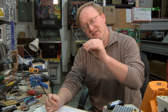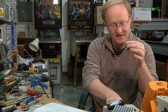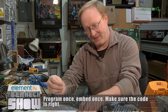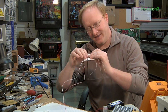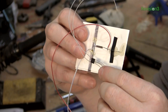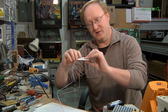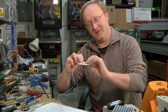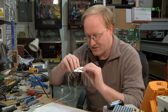I'm attaching wires manually to the surface-mount ATtiny45 and putting headers on the end so I can stick it in the programmer, then pull it out and embed it. I'll use another card and rebuild the circuit — much simpler this time — into a nice flat solution, and attach the piezos. It'll basically be the sensor, the ATtiny, two batteries, and a piezo — possibly two piezos — to really ward off thieves.